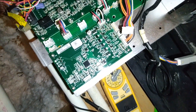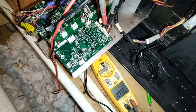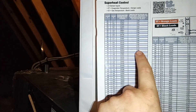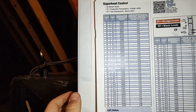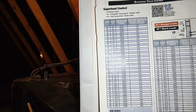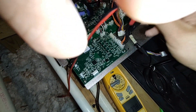At J3 right here, that's 2.7 volts DC. If we find 2.7 on the chart, we're looking at 32 to 34 degrees — so that's pretty normal. If we had way higher or way lower, we'd know that temperature sensor is reading wrong. This is the line temp sensor — this one's always going to be a little bit higher unless the unit is off.